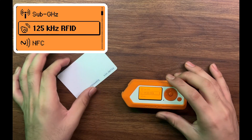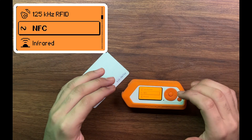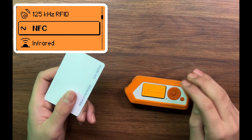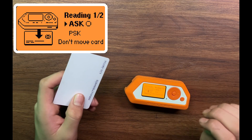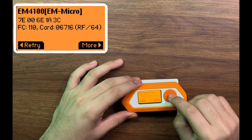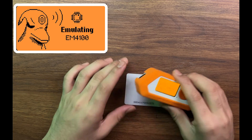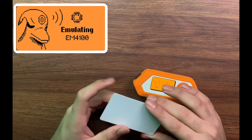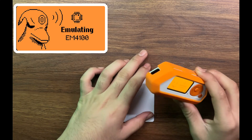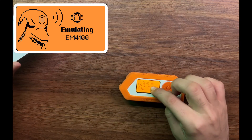Next up we are going to be fiddling with RFID. There are two types of RFID: one is 125 kilohertz and the other is NFC, and the Flipper Zero will allow you to capture both. Right here I have a 125 kilohertz RFID — if you have an NFC it works exactly the same. I'll go to read and place this on the back, and naturally it read it. If I press more, I emulate it — and as you can see it is emulating. So whatever this RFID holds, once emulated it will naturally just open the lock. This is the RFID to a garage door, and if I just put it onto the garage door it will automatically open it.